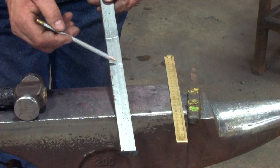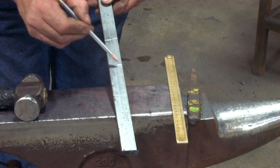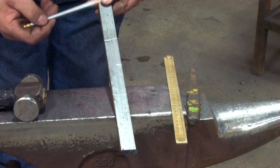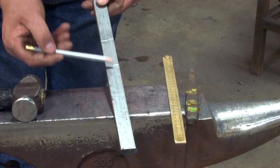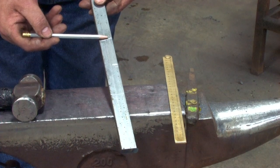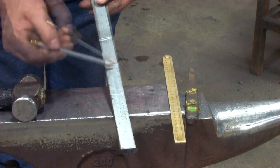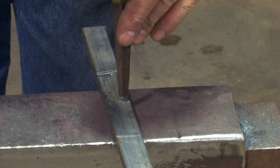I'm going to mark it 6 millimeters towards the inside, so it's 12 millimeters longer on the outside. Once I've marked the middle of the toe, when I heat it I'm going to take two bumping heats — one bumping heat for the outside and one for the inside for the Masselot. So it'll be from the center of the toe to 65 mil from center, and from the center, 65 mil. Now we're going to mark it with its 6 mil off center.